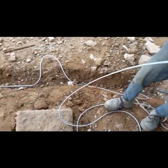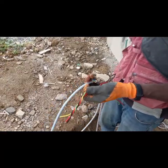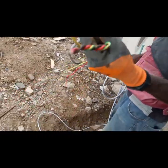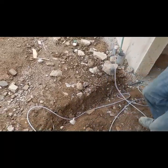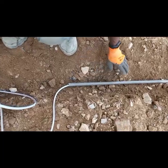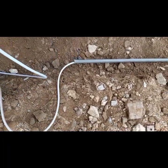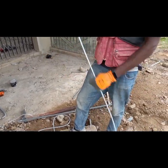When you're doing this type of work, you can use the standard cable for wiring a house, but when you are putting cable on the ground — on natural ground — it is highly recommended that you use this type of cable. We normally call it coil flex. It has serious, serious insulation to protect the cable. Since this pipe has been laid in a trench, there will come a time when water gets into the pipe, and current will be flowing through these cables.